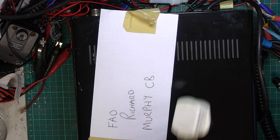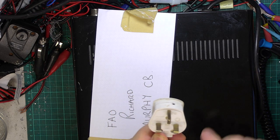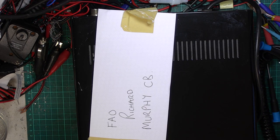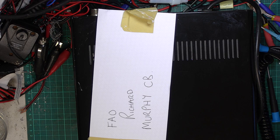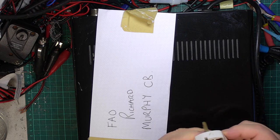that is helpful. First of all, I'm just going to check the plug. And actually, chuck the plug is what it ought to be because it's a non-shrouded pin type. But it's his radio, it's not my radio, and I'm not going to spend £1.49 of his money changing the plug. I'm also going to look for a screwdriver which is more suited to opening it. Because the first thing we need to do is to check that the fuse inside is 3 amp rated and not the full 13 amps that the plug is capable of doing. My late father was one who was really good at putting the wrong fuses in, despite him being a doctor of chemistry.